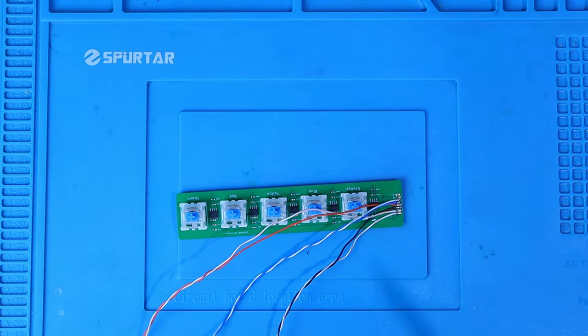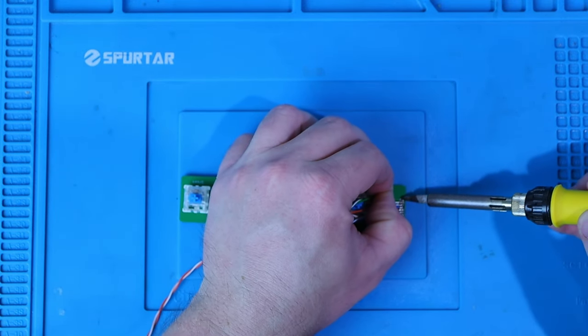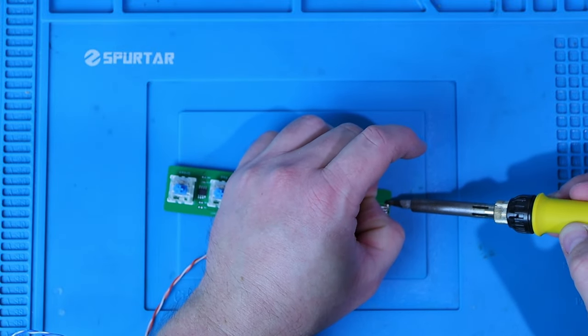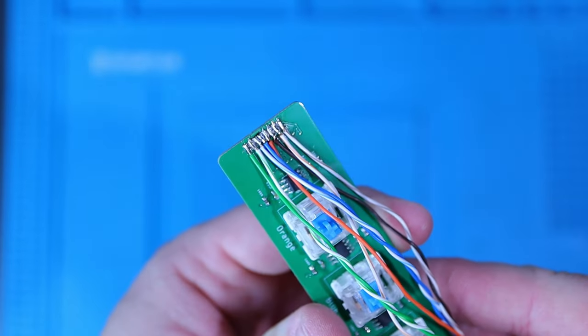Ideally, if you have the correct colours for the fret buttons, it will make it easier to keep track of the wiring. The network cable only matches a few of the fret button colours, so I've taken photos of the neck PCB before I seal it in the neck so I know what to do when I get up to the strum bar wiring.